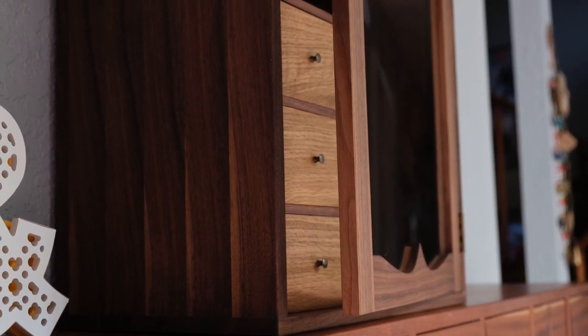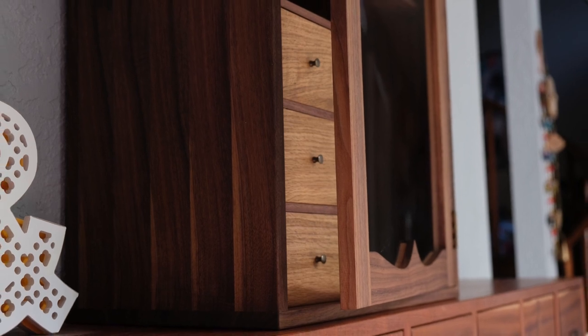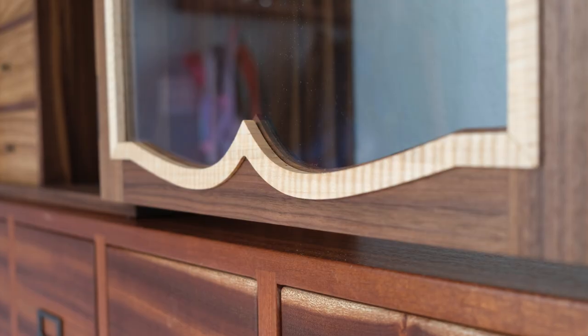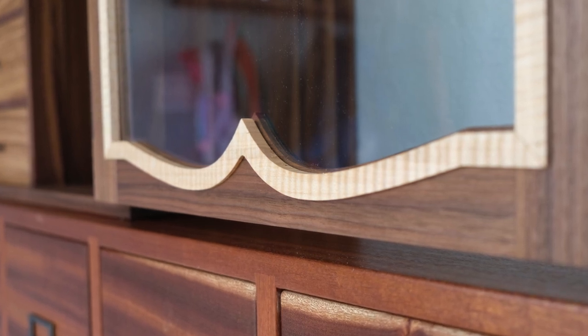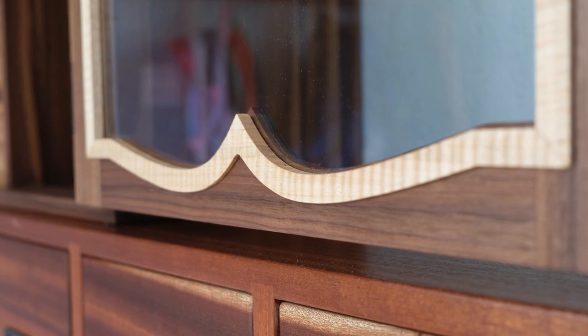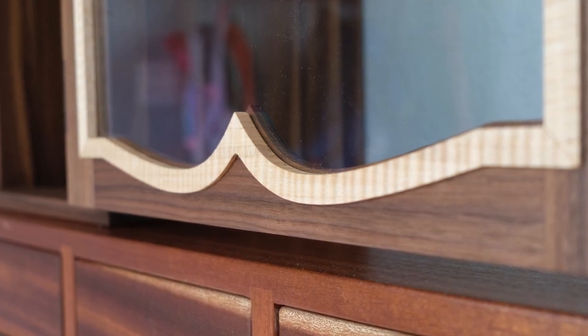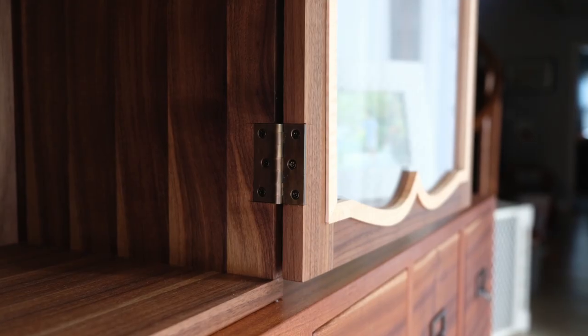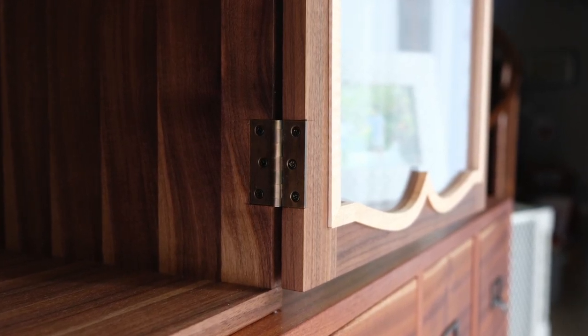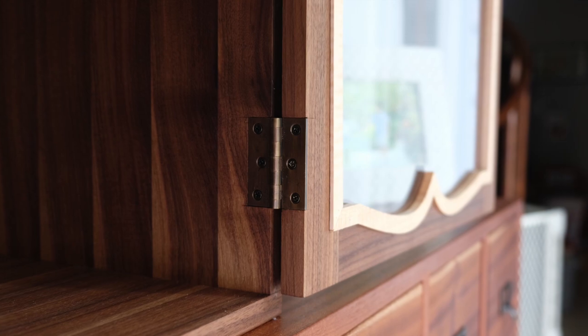A while back, I made what I called an apothecary wall cabinet. This cabinet builds on that design by adding a unique inset door as well as adjustable shelving. The material for this piece thins out as you move from the outside in. The case is 5/8 of an inch, the middle divider 1/2 inch, the drawer divider is 3/8 of an inch, and the adjustable shelves 1/4 inch. This is a design element I picked up from Mike Pekovich, among others.